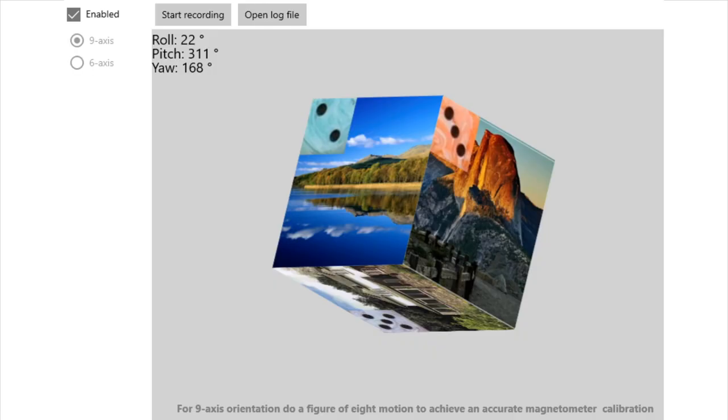The thing that TDK InvenSense, again, they're experts at, is this IMU sensor fusion. So, of course, their demo has this cube: you pick up the bug and rotate it in your hand, and the 9-axis orientation follows along. And it's stable, it works great, there's very little jitter, and very little drift. They've done a really good job, and they give you the Euler angles here.